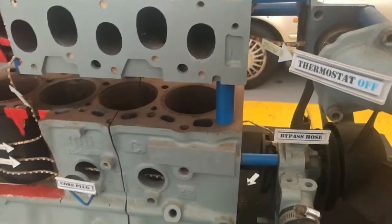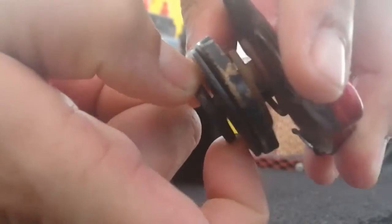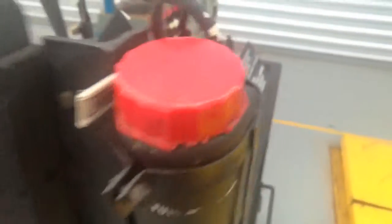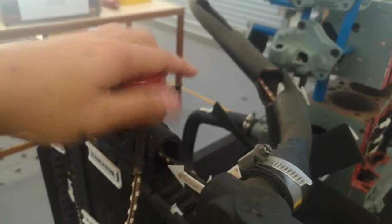As the engine stops, the temperature of the engine drops and a vacuum will be created inside the engine. The vacuum relief valve of the PVRV will open, allowing water from the expansion tank to refill the radiator with water which was discharged during the previous process.